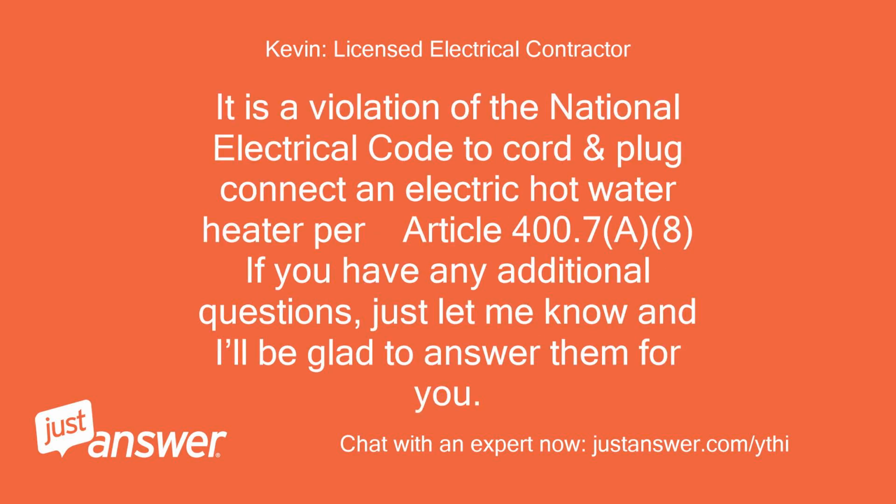It is a violation of the National Electrical Code to cord and plug connect an electric hot water heater per Article 400.7(A)(8). If you have any additional questions, just let me know and I'll be glad to answer them for you.